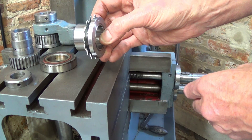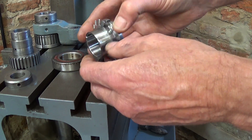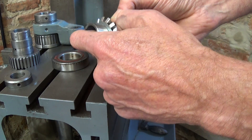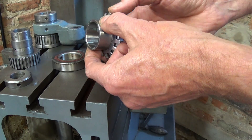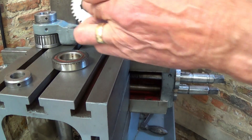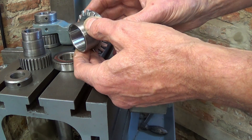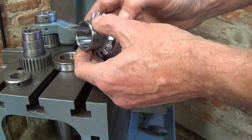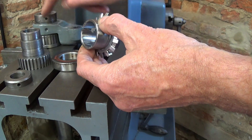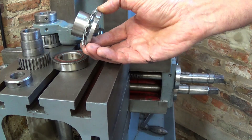That's the purpose of this item, which is called the withdrawal sleeve. It is used with bearings which are tapered in the centre, and this outside is tapered by about 2 degrees, while the inside is plain. So I decided: if I could make a ratchet wheel, machine out the centre to fit this 2-degree taper, and build a new shaft which carried the whole mechanism, I could make a self-contained clutch. That was the idea.